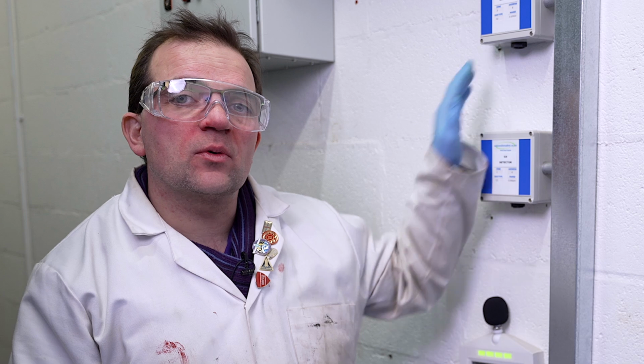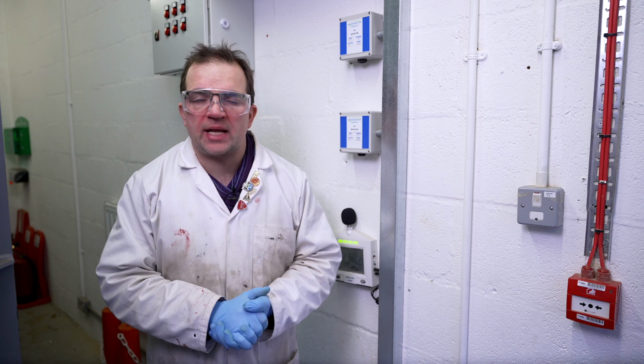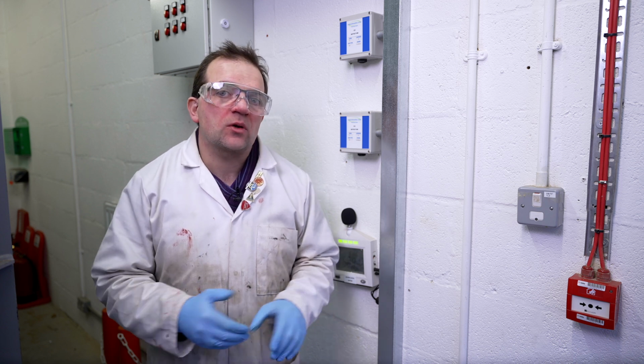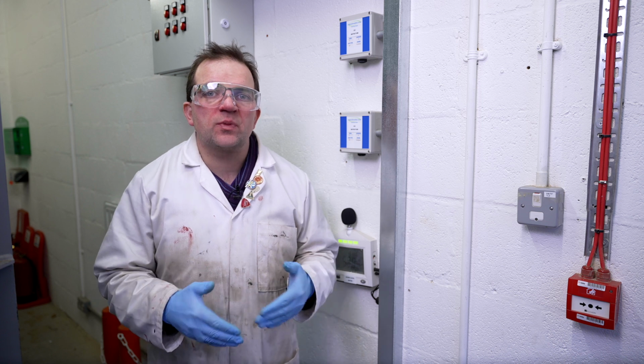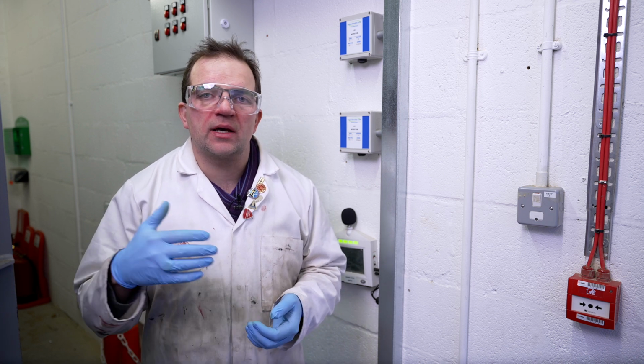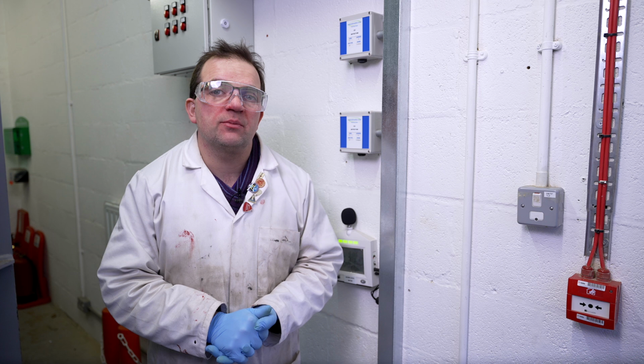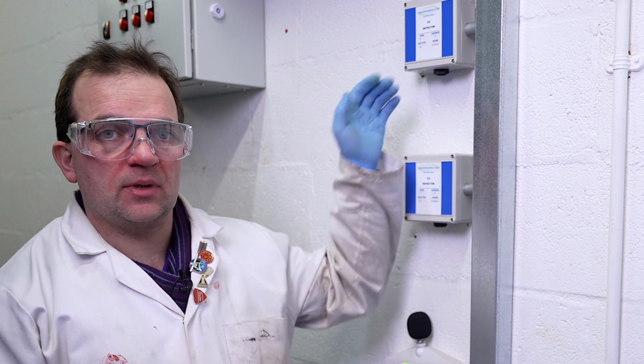So obviously carbon monoxide gas is very bad and we want to limit the concentrations that we're subjected to. But specifically I want to talk about oxygen enrichment and depletion. When dealing with rocket propulsion systems with oxygen, if you perhaps have a leak in the system, you might find yourself in an environment where oxygen gas has built up. This is what we call an oxygen-enriched environment. You've got to be very careful in these environments because any sort of flames or sources of ignition may cause a deflagration event, especially if there's been a large buildup of oxygen in the area.